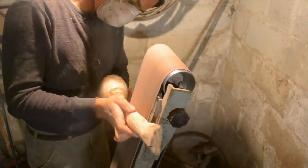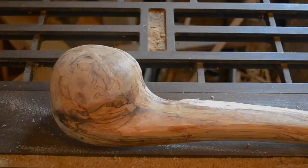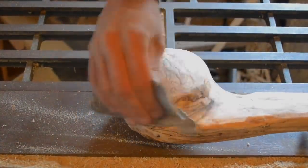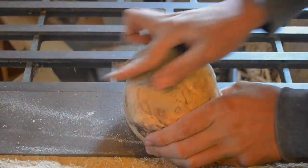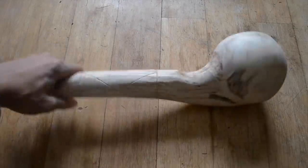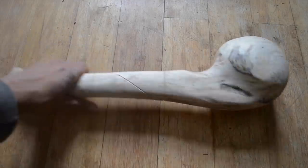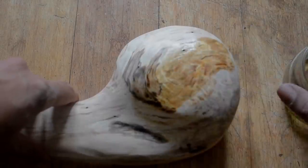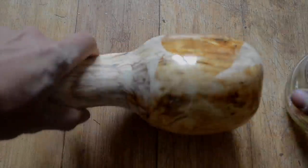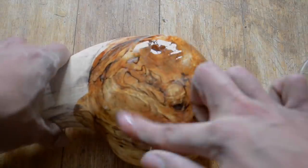Then take down the few remaining corners and go once over the whole thing again. Now that all the shaping is done, it's time to polish it — I recommend putting on a podcast or something while you're sanding, otherwise it's easy to get bored and start missing things. Here's the club after sanding. I've added some carvings for decoration and a carved grip. The final step is to oil it — I'm using walnut oil, which was used historically. Alternatively you could use animal fat, but that doesn't apply quite so nicely. Apply a coat of oil every couple of days until it stops absorbing more.